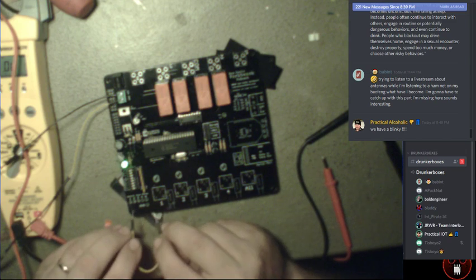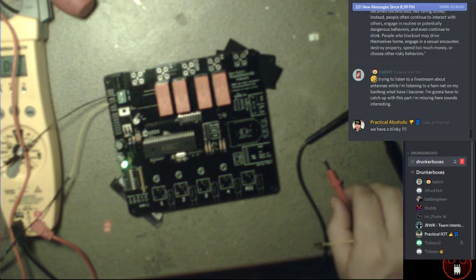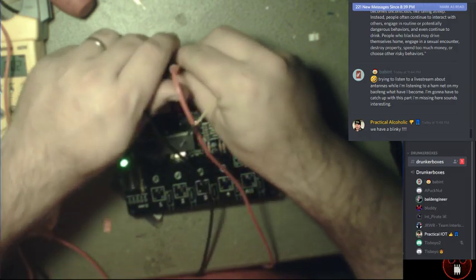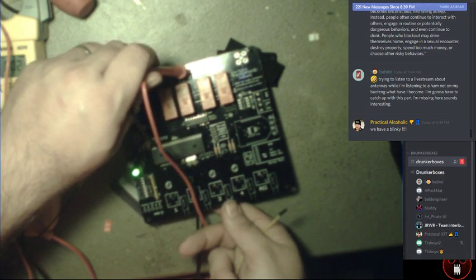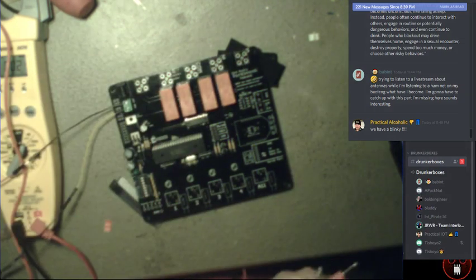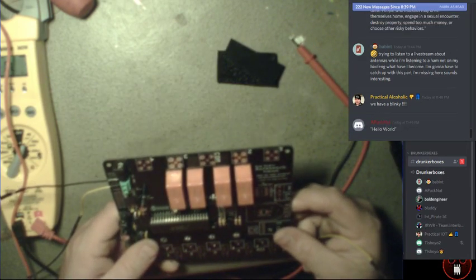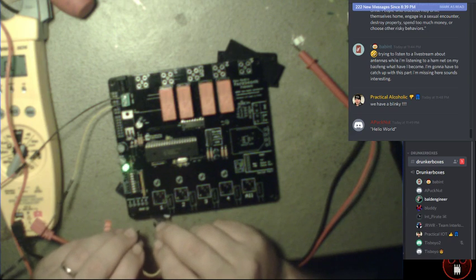And then, look up PCI Express signaling and how that crazy stuff works. Yeah, that's what I do every day, dude. Oh man. I helped write the first spec. Oh, sweet Jesus! So you're the one that I have to pick a fight with now. I made a lot of money convincing people they need it. No. I'll give it this. PCI Express actually has a really good link layer protocol, at least in the fact that you can still slap it on a shitty cable and it still works at 1x. Well, but it's not the link layer that does it. It's all of the equalization and pre-emphasis that happens on the physical layer.